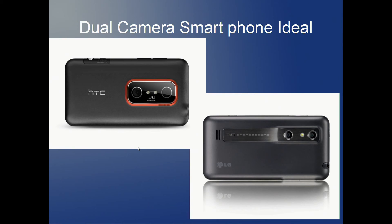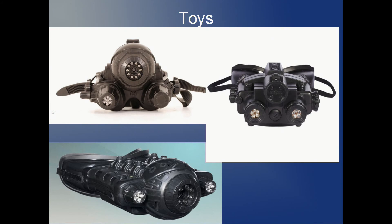There are smartphones with dual cameras that exist today, but the problem is those cameras are too close together. For a night vision goggle application, this simply won't work properly — the cameras are offset from the eyes and too close together to reproduce depth perception correctly. Beyond a certain number of feet in front of you, you'll actually lose depth perception entirely.